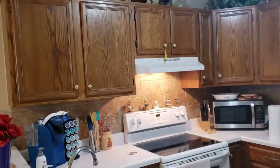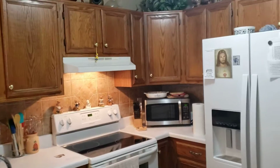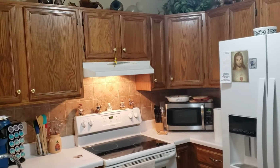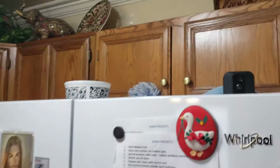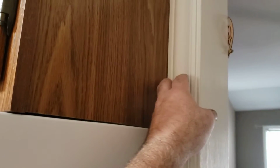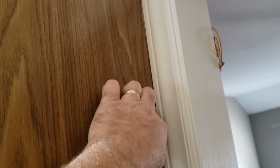Otherwise, we've made a little bit of change on the cabinet layout because of some situations. The measurements that you have are wrong as far as the back wall and side wall, so we're making some adjustments on those. If you take a look here, the cabinet above the refrigerator is 36 inches long. It's a standard. But if you look, there's only 83¾ inches on this wall. So this standard cabinet with a quarter reveal is tucked in right behind that molding.